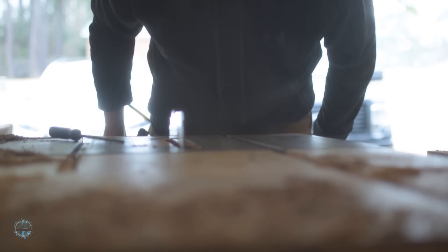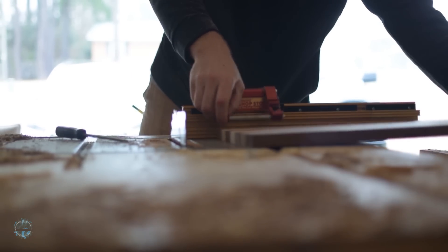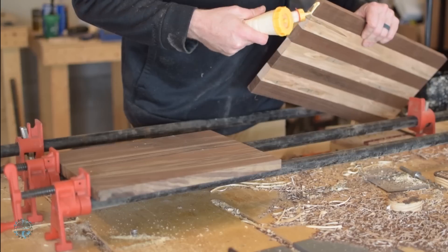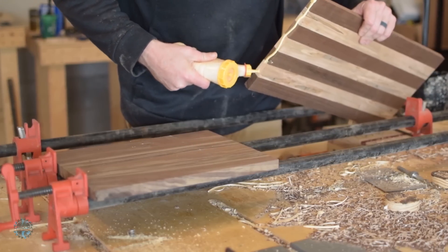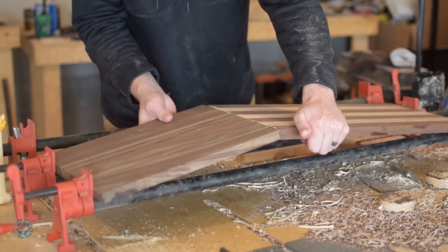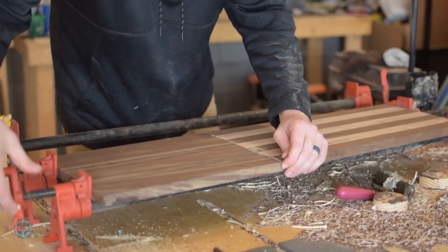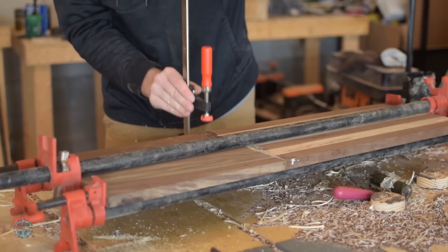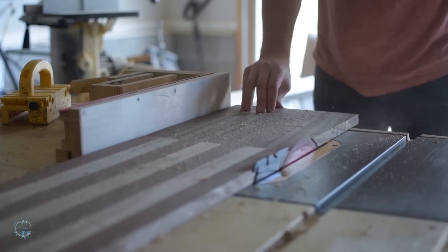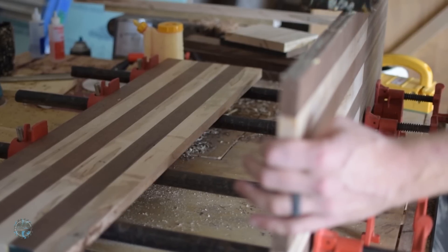First, blow your dust away — that's key. Then on the union and the short stripes, I trim the edges that are going to be glued with the miter gauge to get a perfect 90-degree edge to glue. I glued the union to the short stripes to make the top of the flag. The match wasn't perfect, so I trimmed the blue edge with the table saw and then glued the whole flag together.